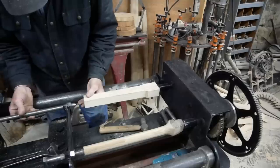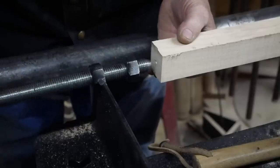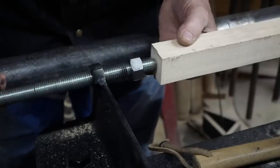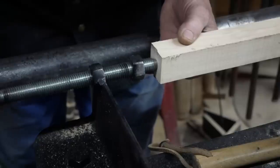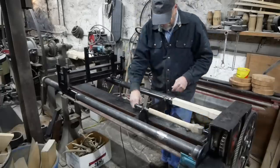On the blank side I have this extra-long threaded tailstock. Sometimes my patterns are longer than the piece I actually need to turn, so I can put in a long pattern but yet turn a short blank.